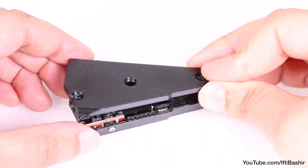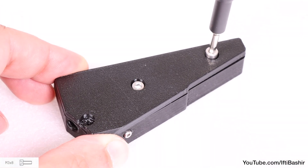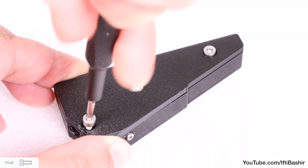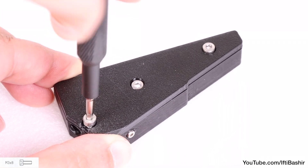Pretty smart. Go ahead and place the cover over the top and secure with an M3x8 screw on either side — these go straight into plastic so you'll feel some resistance, but tighten until snug. Do not over-tighten as you risk stripping the created threads.